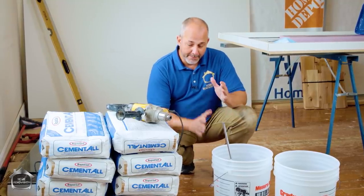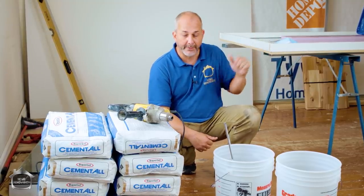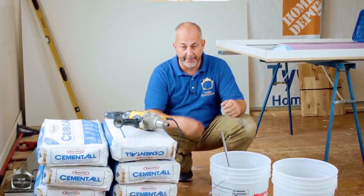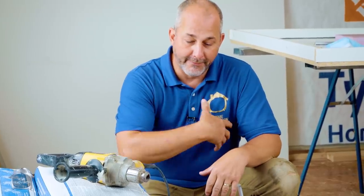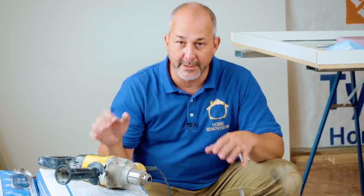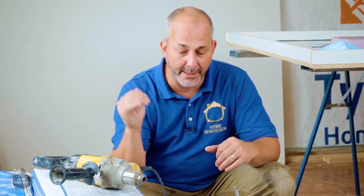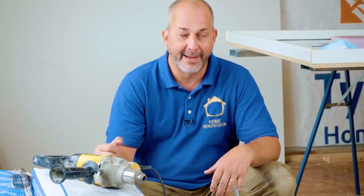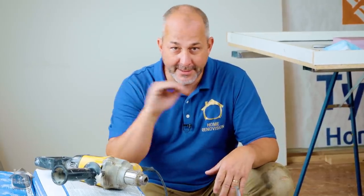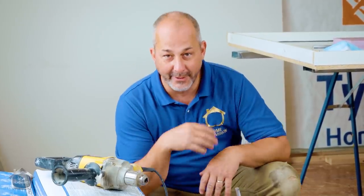The secret here is we're gonna be mixing this, and instead of pouring it into my mold, okay? We are going to be using a different system for setting the beginning of it. I'm gonna be using a sprayer to get a real continuous, nice coating on the entire mold first before I start mixing this up and pouring it in. That way the finish isn't gonna have any lines and set lines. Because it sets up so fast, it's gonna be like the other video that we did where we had layers. You could see it was almost like a sandwich, a cement sandwich. We don't wanna have that happen again. So this way, we're gonna up the technique.